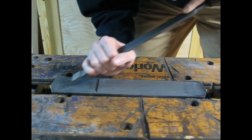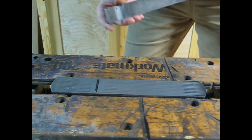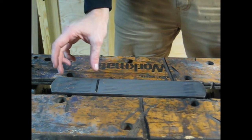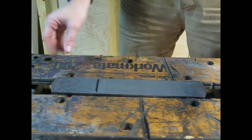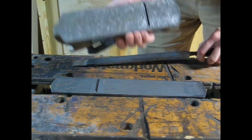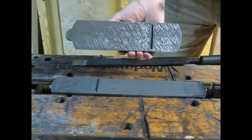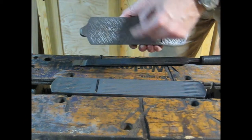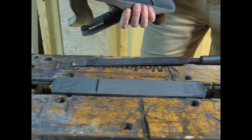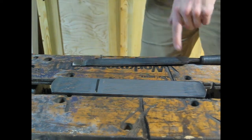I'm not going to fill the corrugations — I'm just going to get this thing flat. We take all the blue off, retouch it to the surface plate, and the blue region will expand and eventually cover the entire surface. In the case of our smoothing plane, we've got dots of contact uniformly spread throughout the whole thing. At the end I'll touch this to the plate and show you, but I'm going to keep working on this.